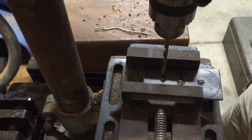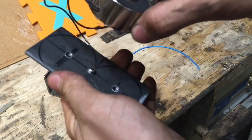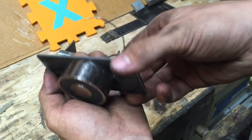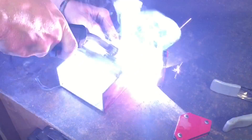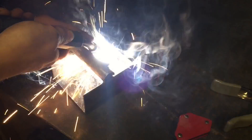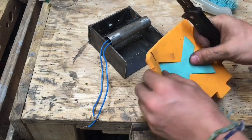Now that I had both sides ready, I cut out the front part of the gauntlet. Since the electromagnet has a threaded part inside it, I threaded a quarter-inch bolt inside it, and through the tapped holes I was able to attach the magnet. I only used one of the holes — I was hoping to use two electromagnets but the company only sent one. Once I get the second, I'll mount them side by side using the side holes.